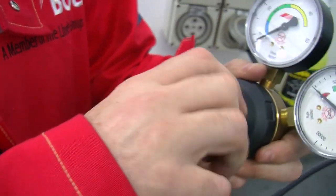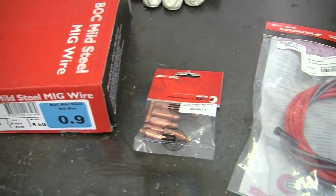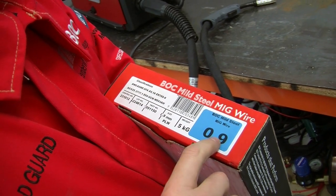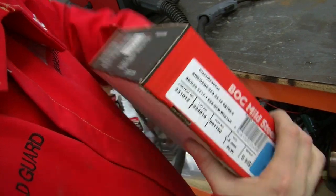Check that you have the right material to be welded: shielding gas, consumables, welding machine, and personal protective equipment. For 5mm thick mild steel, we will use 0.9mm MIG wire.